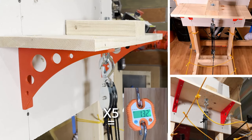The parts attached to the wall split in half along the screw holes, and the brace snapped at both ends. It looks like the failure points were where the solid walls met the infilled areas. If the brackets were printed completely solid, they may have held even more weight.